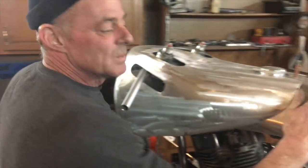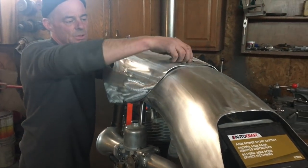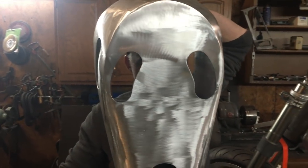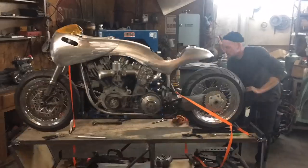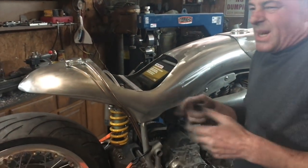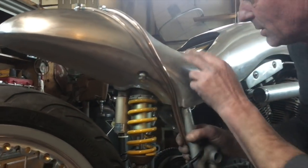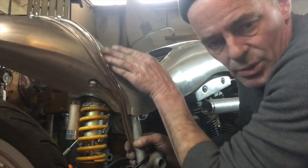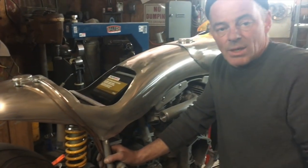A lot of the metalwork's done now — finished sanding, I've got it closed. Then I think I'm going to polish everything for something different. I know this is kind of a unique fairing — it kind of looks like an Australian fertility mask, but I already got a bunch of kids that I love. Maybe I need an infertility mask. There's a lot going on on this side, but I want to make the other side kind of interesting. I like to keep the mechanical aspects a lot of exposed — I just like that sort of shit. I did my oil lines as I showed you the other day, making up these hard lines here. I finally got the bottom of the oil tank welded in — that was a little challenge. Had to put a welded bulkhead here. It was tricky getting these welded on the inside without warping this. These will all polish up a little more. Once this is polished and brushed, I think it's going to look lovely. I'm really close to getting this done where I can take it apart and polish it.